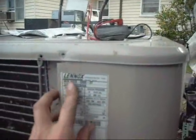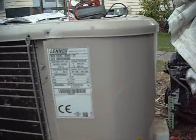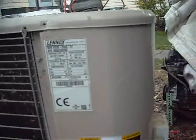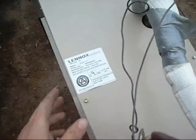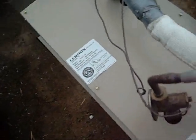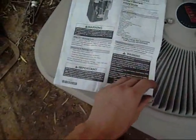The actual unit is model number HS29-036S-3T, serial number 5803D38456, normally contains 2.07kg of R22. The indoor unit is a CH23-51. Maximum design pressure is 450 PSI, so it's fairly high, but not that it'd run that high. It's only got a TX valve on it so I think this thing's cooling only. America seems to be the central hub of warning stickers and things that are known to cause cancer - seems everything in California is known to cause cancer.